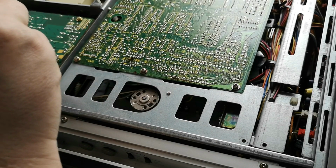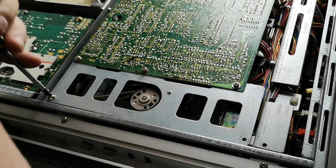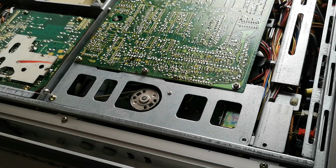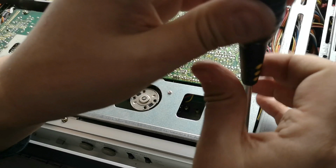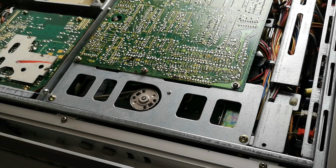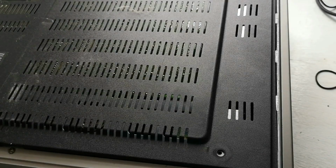The newer decks, I think, have actually got all of that control on one of the boards that mounts directly under the machine, as an individual part of the board rather than taking up an entire board in its own right. So it really just goes to show how in just a couple of years, this machine's a 1981 deck, and the VR3982 is a 1983-ish, 84-ish deck. It just shows how in that short period of time, Moore's law of miniaturisation has taken hold, so to speak.